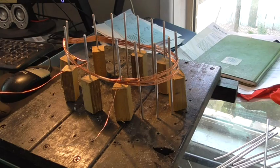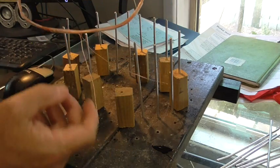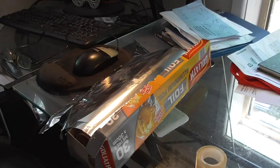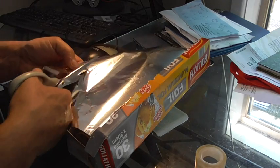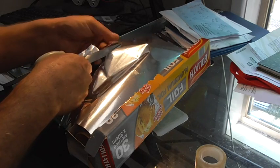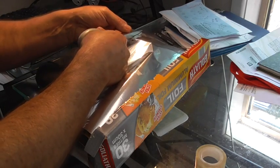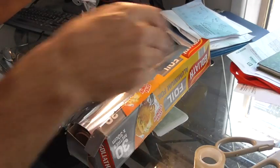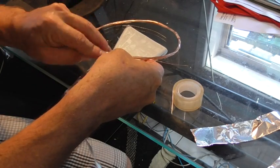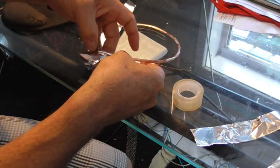Let's go around the whole thing. Now we have our detector coil. All we are going to do now is just scrape the insulation off the tips. Now we are just going to cut some strips of aluminium foil. This will help protect the coil from unwanted interference — we call it a Faraday shield. Leaving a gap at the ends there, just fold and twist that around, and get it around the whole thing.